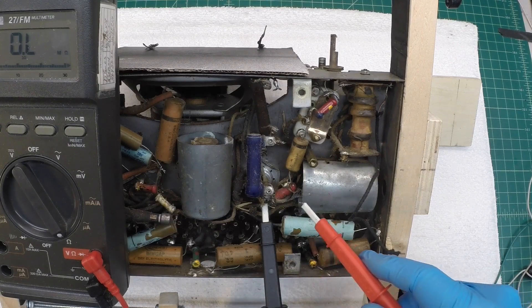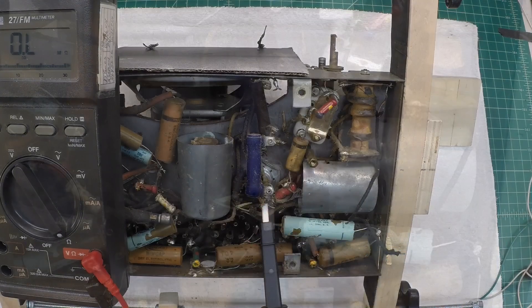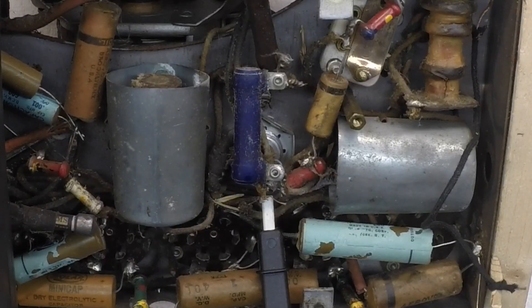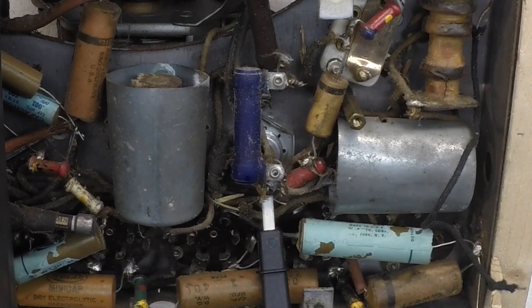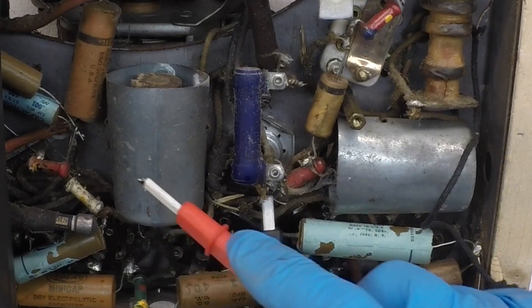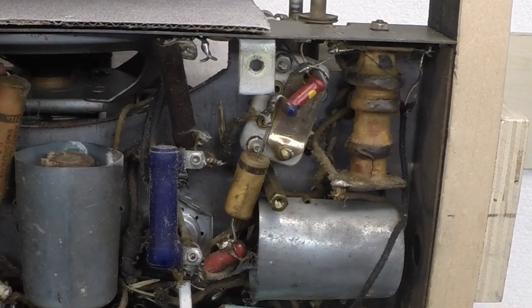These things are such a mess — all these wires have been spliced, you can see here. I think I'm going to pull both transformers out of the set anyway. There's a lot of crud back up in these cans, so I'll just get them rewired and checked. It may just be a mistake on my part not being able to read the DC resistance, or there may be a problem with the transformer itself. So let's go ahead and finish checking the oscillator coil.